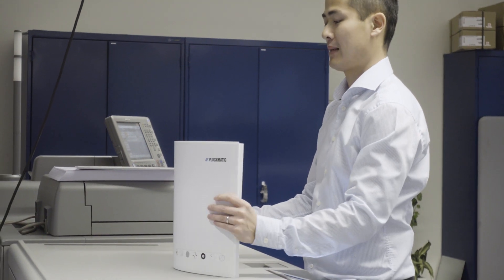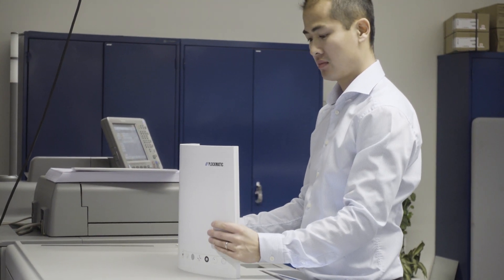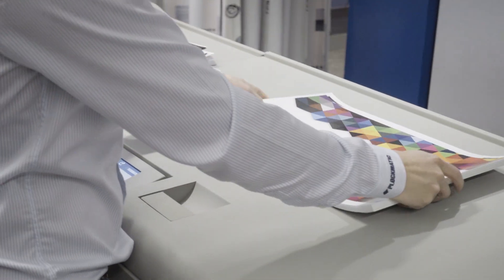If the paper needs to be loaded in the trays with the edge pointing down, then simply insert the measured value as a negative curl amount on the GUI. First, take a sample of the stack about 15mm or half an inch high, and place it on a flat surface with curl up. Then, take the midpoint as reference and do all measurements within the marked area of the picture, from the center to the leading edge in paper feed direction. Measure the lowest point of the stack of paper, then measure the height of the leading edge. The difference between the leading edge and the lowest point is the amount of paper curl.